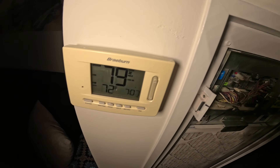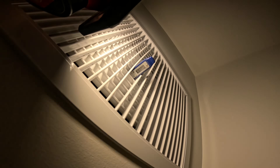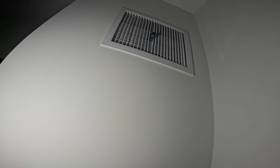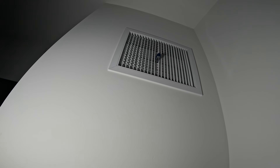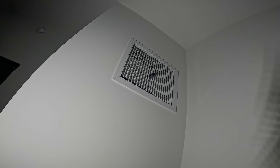It's 79 degrees now — it was just 80. And we have 62.2 and dropping. At this point when it was at 80 a second ago, that's an 18-degree TD. And as the room temperature drops, so will your supply air temperature. It's looking good to me.